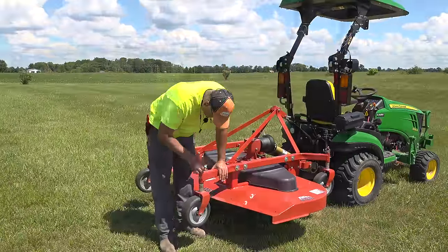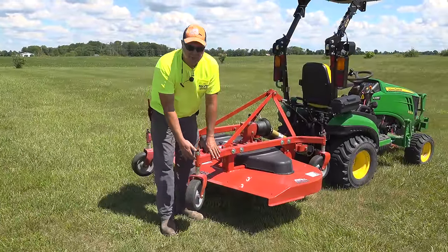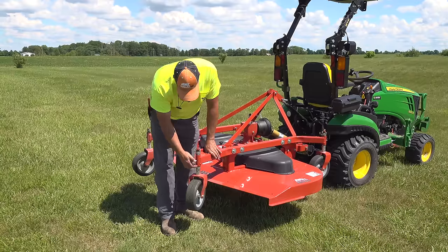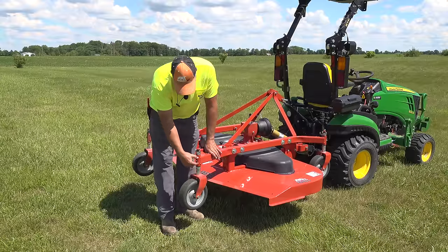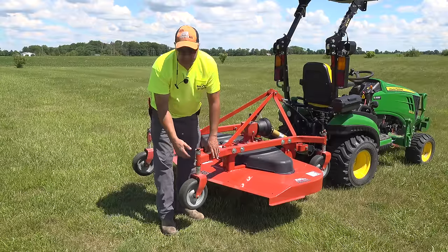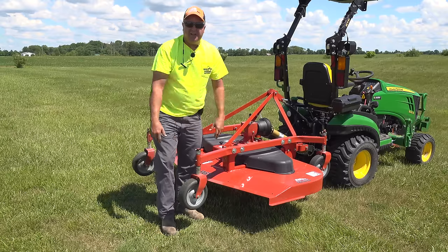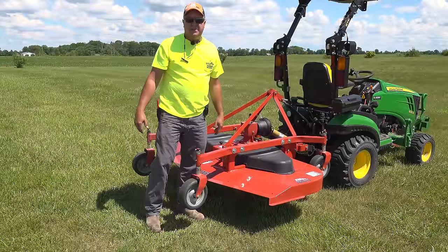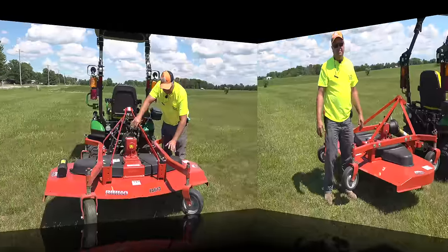It's kind of greasy, Christy, but it's nice to keep this all well lubricated. But this is how you do the height adjustment. You can see these different sized collars, and you just move them from below this to above it to change, you know, to make it go lower. And you've got all different sizes, so you should have an infinite height adjustment in that regard. So we made that adjustment earlier and raised it just a little bit. It helps a lot.